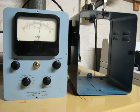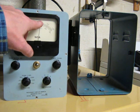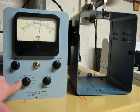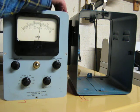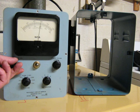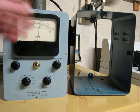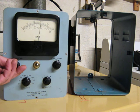I've already preset this up. It has a voltage adjust — I've got it set to 900 volts. This dial here is set to high voltage, and that's where you adjust the voltage according to what probe you're using. This probe wants 900 volts. You can go up and down a little bit — plus or minus 50 volts or so — and it'll be pretty close in spec.